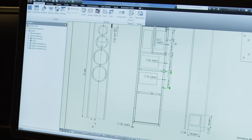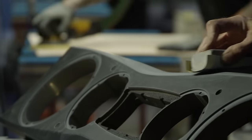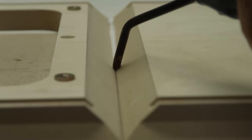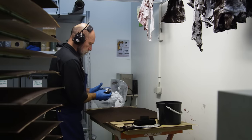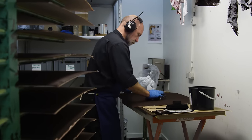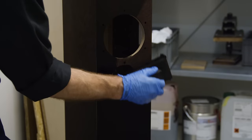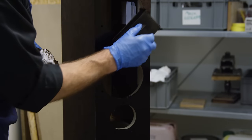That's like bi-amping, tri-amping, or quad-amping. What's also important in a loudspeaker is not only the drive units but also the quality of the cabinet. We build cabinets in-house in Skanderborg. For example, we fold the cabinet so the veneer goes all around the loudspeaker, with veneer on both the inside and outside of the MDF panels. Without veneer on both sides there is a lot of tension in the material, so this makes it very rigid and very stable.